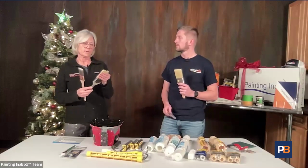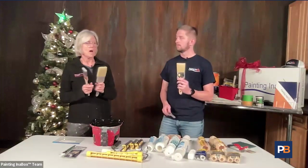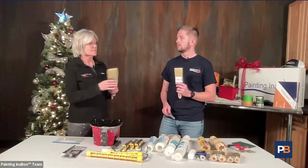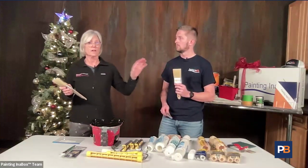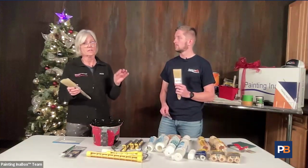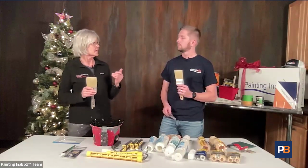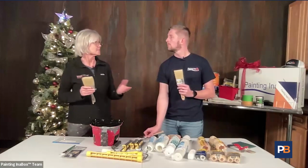And these brushes, the straight edge follows, and not all ceiling lines are easy to cut, but as long as you've taken care of your brush, this will follow a cut line or make a nice cutting or trimming line near a ceiling. It gets nice in corners, as long as you've prepped it correctly with tape, and it covers nicely because it's nice and thick.